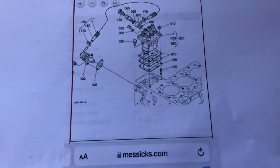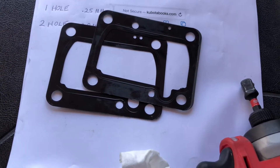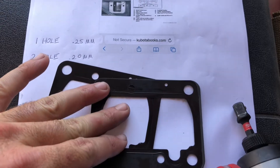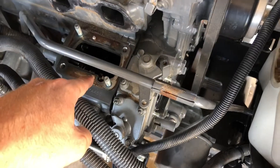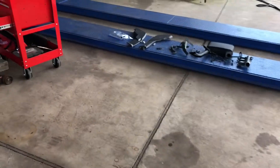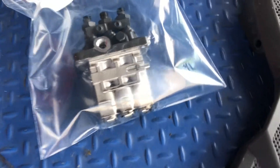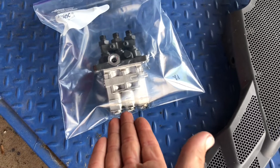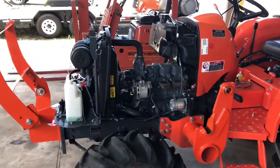Here's where a bit of confusion comes in — and that is for an L2501. What do you see? Three gaskets. Things can change from year to year, but that is what we are working with on a 2020 L2501. So I'm actually getting some anaerobic sealant and we are going to seal this machined surface to the pump, which I have sitting over here. The bottom of the pump is also a machined surface — there should be no leaks. I have it in a bag because I don't want any dirt getting in it. Easy $1,100 to $1,200 pump right there — treat this like your life depends on it. Let's get some sealant and get this pump back in the motor.